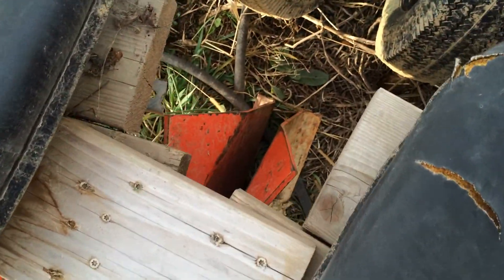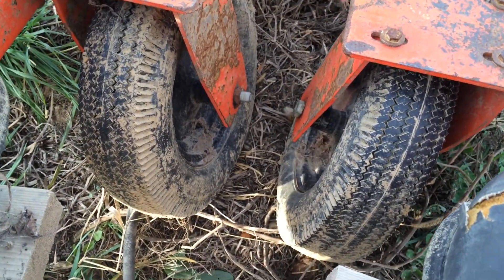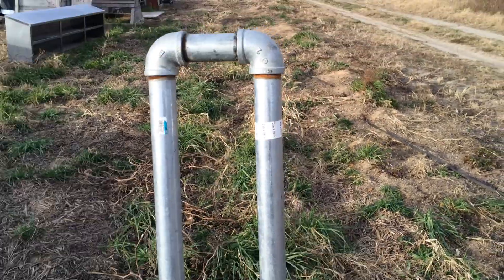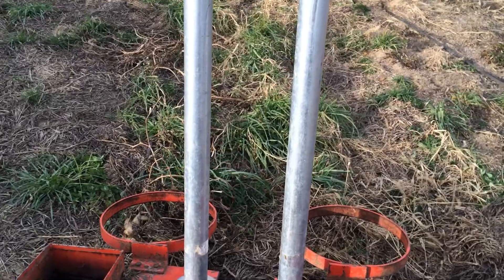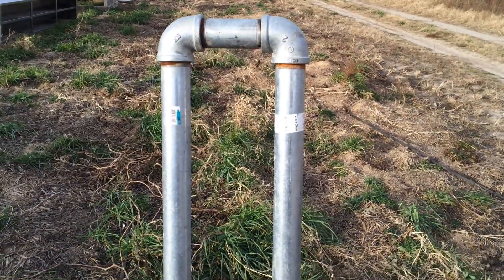When the tree goes into the shoe bare root and into the soil, the tires act as packing wheels and pack the soil behind it. Then it can pass through this gate here — the Arc de Triomphe — and it won't impinge on the tree. So you can plant taller bare root trees, and they're a lot happier and their bark stays happier.